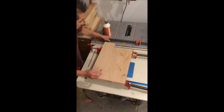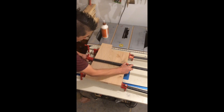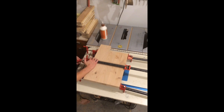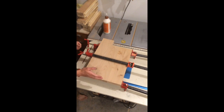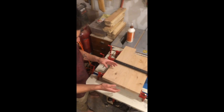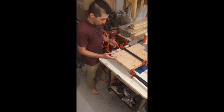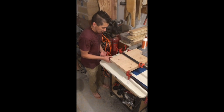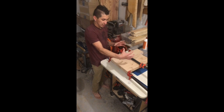I'm going to get this in here real light, and then put a third clamp on. Having a clamp on the opposite side of the other clamps is crucial to creating a nice, even distribution of pressure. Since I know my joinery is solid and my glue technique works for my whole glue-up technique, all I need is enough pressure on these clamps as if I was just holding this together — and you can see a little squeeze out here, and that's good.